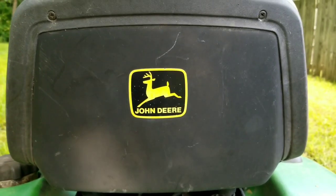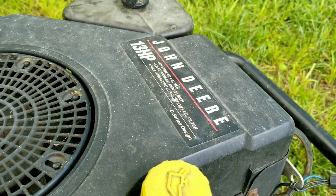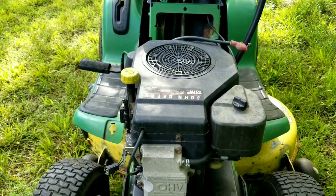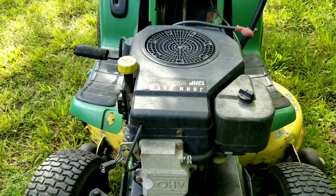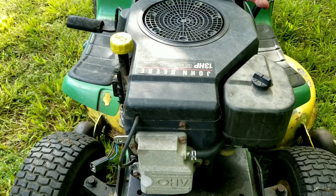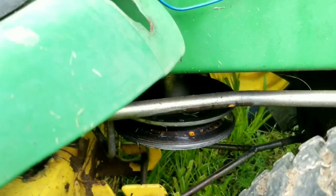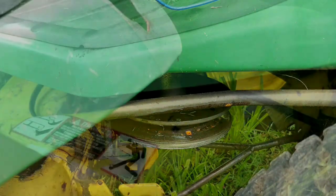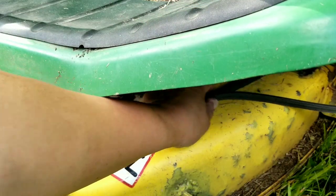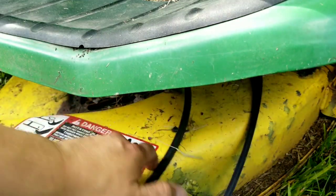I'm not sure how you feel about John Deere mowers, but I have to say this mower is built very well. However, it does have its issues - the plastic hood is prone to breaking and it's been missing for quite some time. Of course you don't need a hood to mow, but the real problem is when you disengage the blades, the belt wants to come off. The belt usually comes off the drive pulley under the engine, and it's easy enough to fix - it's just a real hassle.